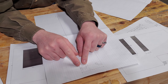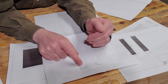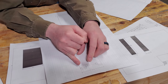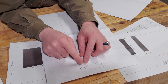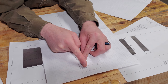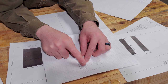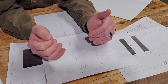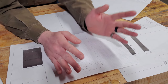For the joinery on the toe kick, a cabinet standard is three inches, but it didn't look right to me. I split the difference of that three — this is a three-quarter-inch board, so that puts it in the middle. That leaves three-eighths on either side of that, which gives you a one-and-one-eighth-inch space on either side. This top is going to be just flush with the edge.